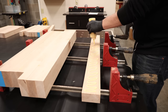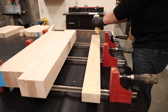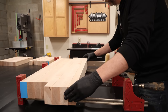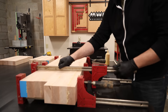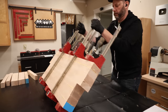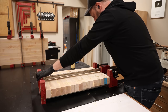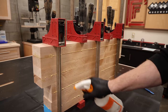I'll show you why that's important in a few minutes, but first I need to glue all these up into larger blanks. Yes, I did just cut them up, and yes, now I'm gluing them back together, but in a different direction. Welcome to woodworking. These blanks are going to form the various parts for the trestle style legs of the table and two bench seats. A quick time saving tip here is to glue up multiple parts using one set of clamps — just remember to only glue the joints you want and not create one huge mega leg.